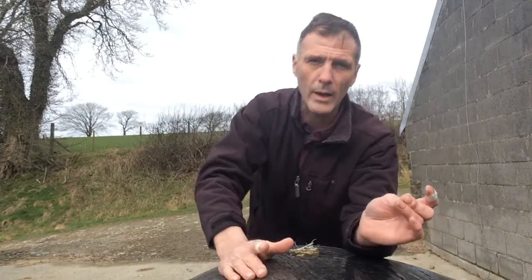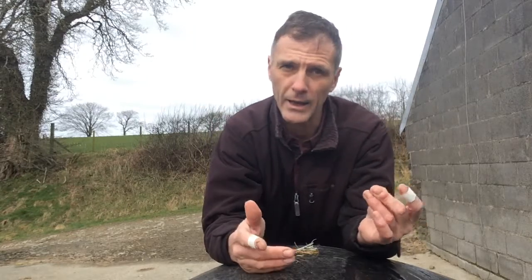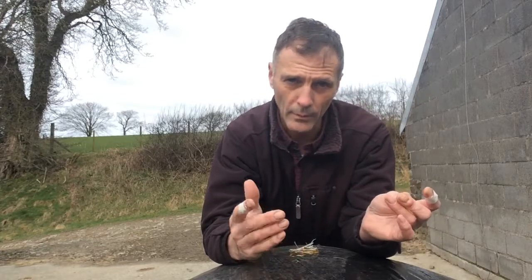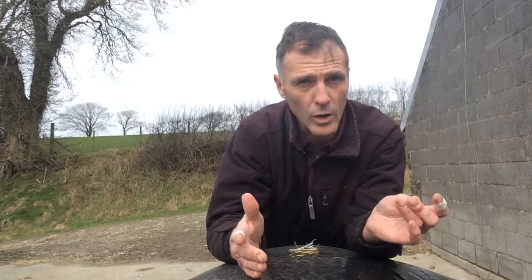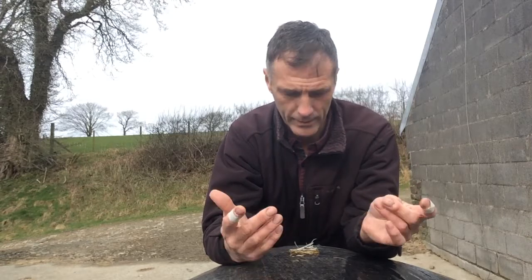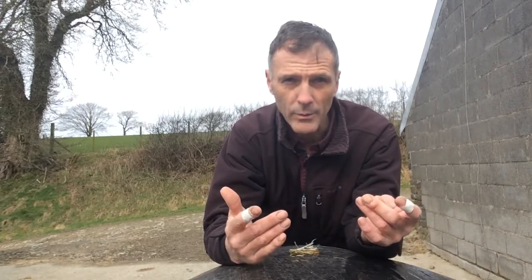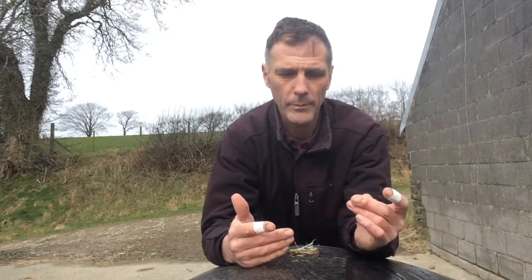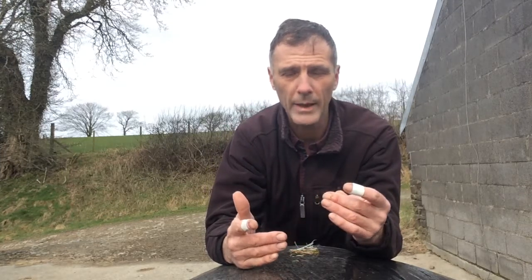Applying 6 layers of film, like we have done on this bale, will lead to a much better fermentation and preservation, and leading to very little mould growth on that bale, as long as there is no physical damage to the film as well. So as I said, this is a useful measure for you to do to understand and ensure that the job has been done properly.